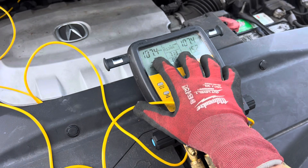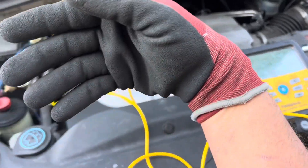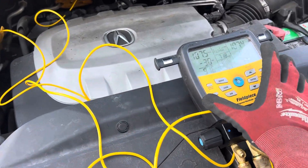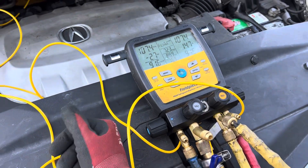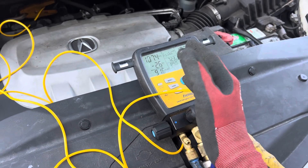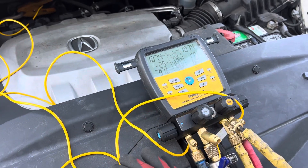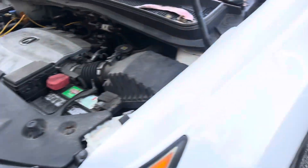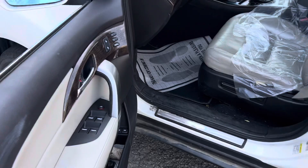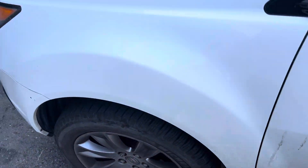Well, 107 psi means it's not over 440 psi, so it would not be cutting off the high pressure switch to stop the compressor from working. And it's not under 20 or 22 psi — whatever the manufacturer uses as a spec to turn off the AC if it's really low on refrigerant. So 107 psi high and low side — we must be really good. That's what I hear from some YouTube professionals. Let's start this MDX up and see where it's at.